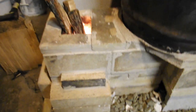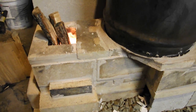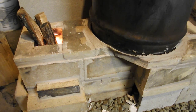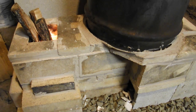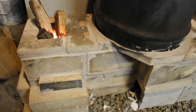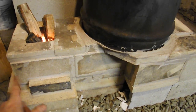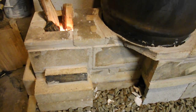The construction method is basically stacking fire bricks. I used thin wall wherever possible to keep the mass of the heater core as low as possible. I should have it insulated — I do not, I'm not there yet. I wanted to see how it runs without insulation, and it seems to run just great without insulation. Nonetheless, I will be cobbing it in, as I said before, in order to create the kind of structure I want and to make it very safe. So thin wall fire brick joined together with — way too hot to touch — joined together with furnace cement.